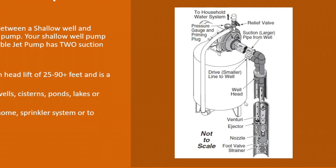When you prime these pumps on a convertible jet pump, you not only have to prime the whole front portion of the pump, but you also have to make sure that both those drop pipes are filled with water as well. The reason being is when you start pumping water on that system, it's working through both lines.